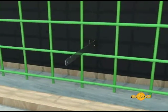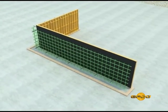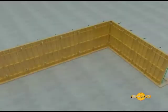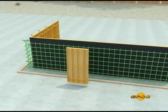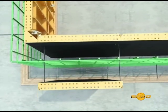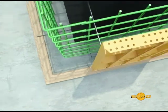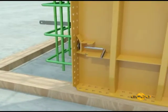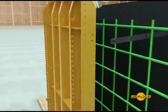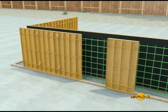Step seven: once you have established and set the first side of the wall, you can start erecting the second side. Place the first form to be erected directly opposite the opposing panel closest to the corner — this positioning is important to ensure proper alignment of spreader ties. EFCO provides various size take-up panels to accommodate the corner. Insert the tie and pin, then clamp the panel and nail to the base plate. Continue adding form panels and connecting spreader ties with the tie pin, as indicated by your form erection drawings.